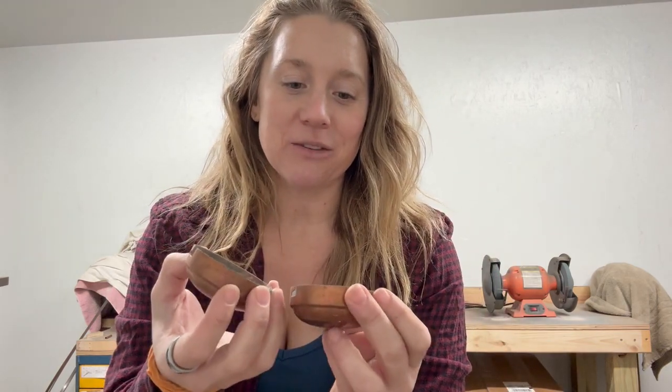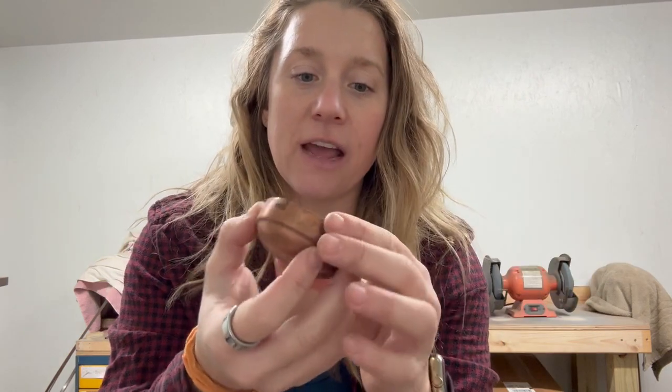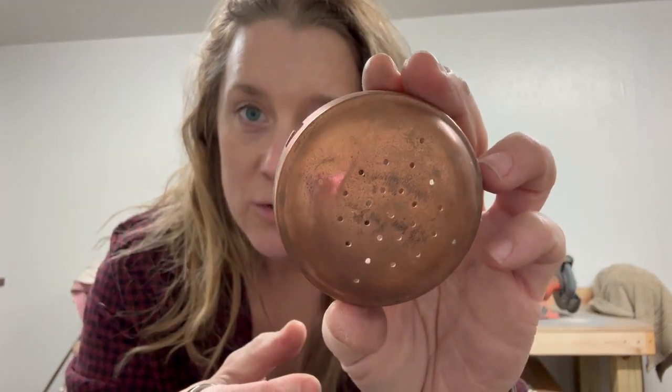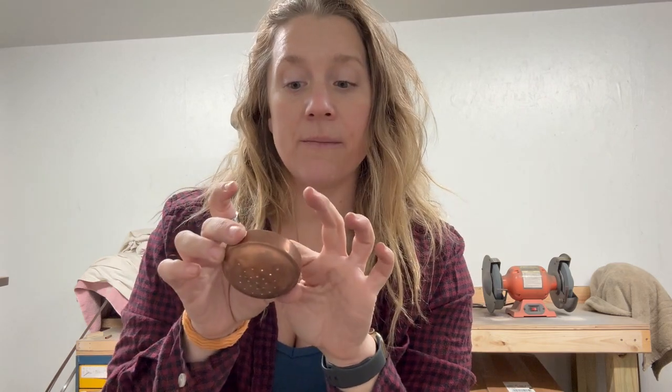These have been sitting and waiting. I've done the bigger pieces with this order already, but these are the last things just because they're a little finicky. But obviously, like always, you remove all of the oxidized tin on the inside. If there's none, fine, great. And then you actually have these little tiny holes that you don't want to plug with tin. And there's a way to wipe very quickly when you're retinning something with holes so that you don't clog the pores, as well as obviously you will be putting something on the outside to keep the tin from dripping out or also clogging the holes.